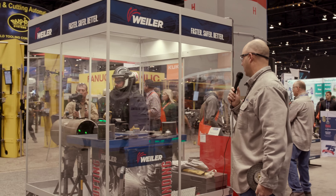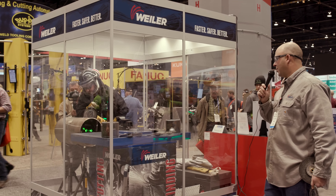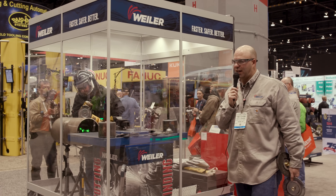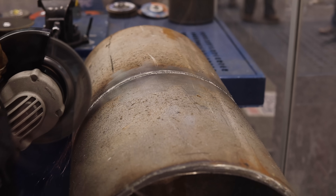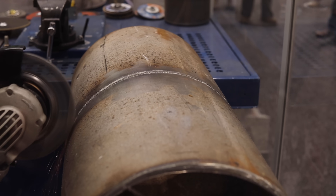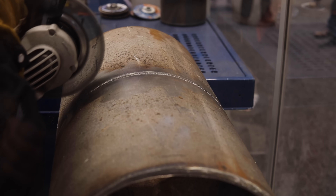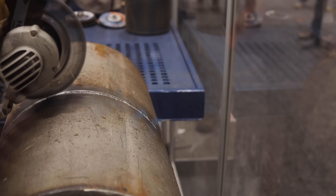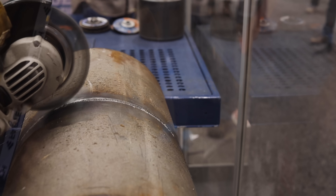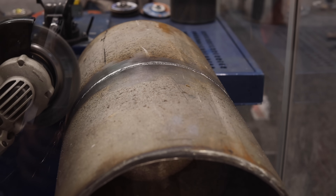As he starts up, you can see it's a little different — it's throwing a lot less sparks. Those sparks it's throwing are really the BBs and other materials coming off the actual pipe. As he goes outside, you can see how easily that scale is taken off — any type of BBs, weld cleaning, or removal of inclusions as he goes through there.